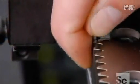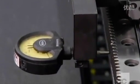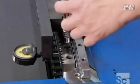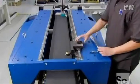A rack and pinion system propels the motion unit. The system's racks must be perfectly aligned for the machine to cut accurately, so a technician uses precision measuring equipment to check the racks, then various tools to make adjustments.